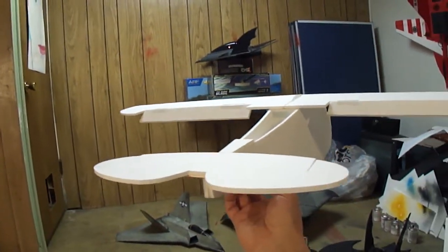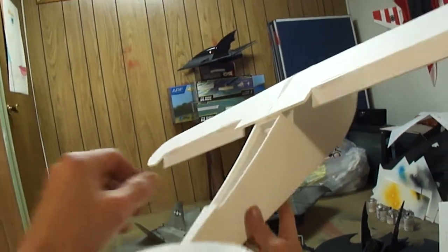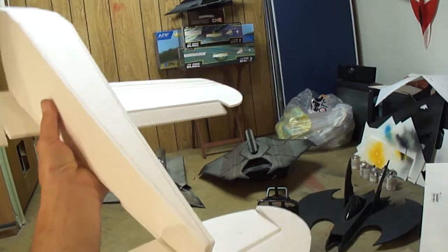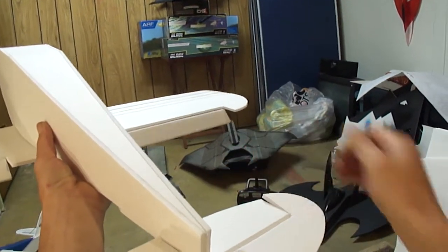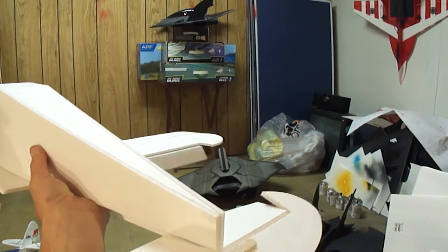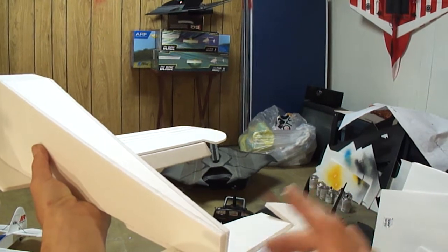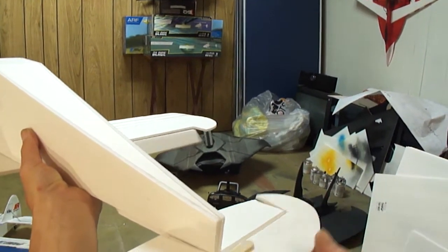My buddy Sean wanted me to go ahead and show you how to cut out for your hinges without using tape. So again, you just go ahead and 45 out from the back of the cardboard here. Don't cut all the way through, just score it and then 45 both edges.